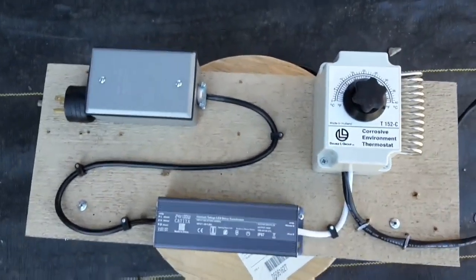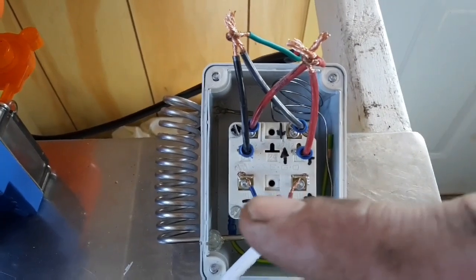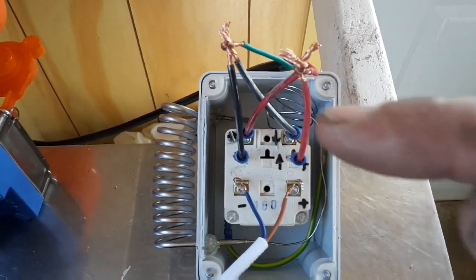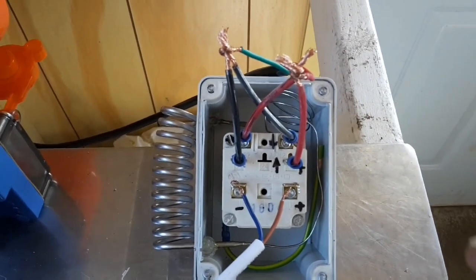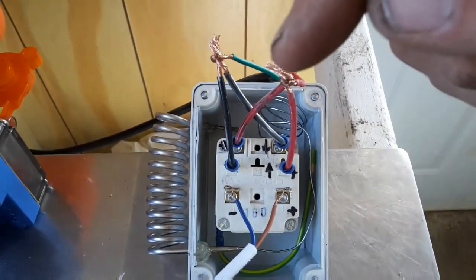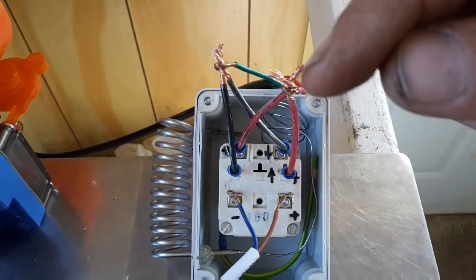It's pretty simple setup, and this is how you wire up the thermostat. We got positive going in, negative going in, these two legs switching in between. This would be the hot and these ones would be the cold. Since it's a 24 volt direct current motor, in order to change the direction we have to switch the polarity. I have the positive on one leg and the negative on the other, same thing over here. They're all tied together and then to your motor. You have to determine which way goes up or down - you simply switch the green and the black coming off the motor to switch the direction at any time.